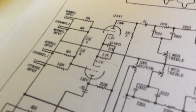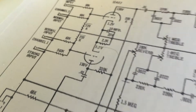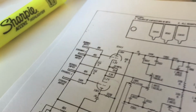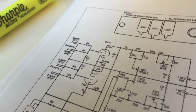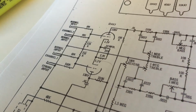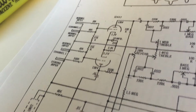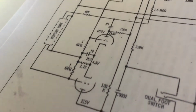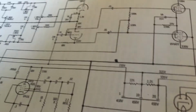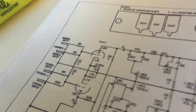We look at the schematic diagram here. We can expect to see, given 117 volts of line voltage, you know, maybe 115 volts in the 1960s, on this schematic, 130 volts. Probably a little bit more of a voltage drop. There's a little bit more in play here, but that might have been compensated for in the voltage dropping resistors. You know, I haven't done a side-by-side comparison of everything here yet, but so I say 150.